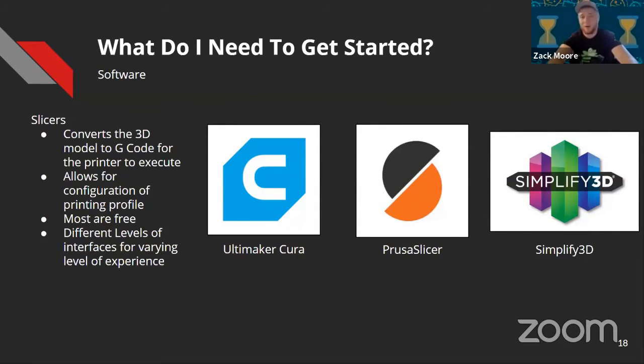The second piece outside of hardware is software — you'll need a slicer that converts the 3D model into G-code. Ultimaker Cura and Prusa Slicer are very user friendly, with different modes for easy use or advanced users, support for multiple materials, and automatic slicing based on pre-configured slicer settings. Simplify3D is a widely used slicer program but is cost-based — though discounted for students and education.